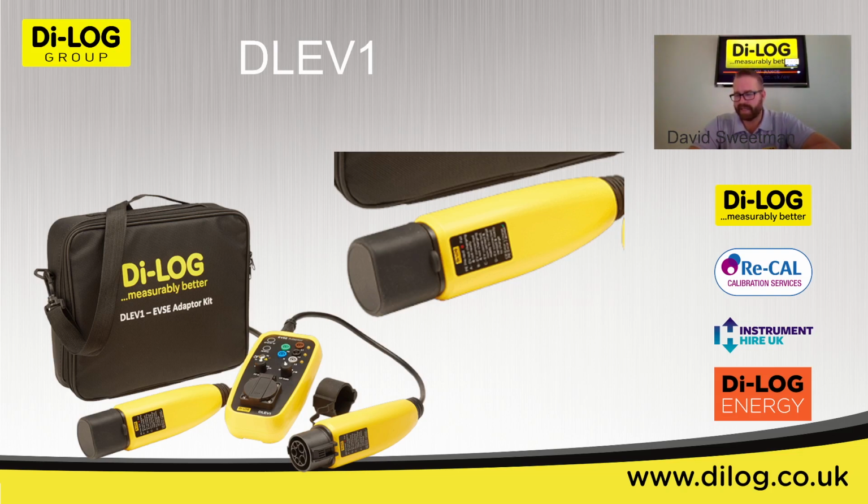Control pilot position B is EV connected and not charging. So when I say connected, this is testing the mechanism that locks the charge lead into the charge adapter and the charger itself. So you're not going to plug your vehicle in and your nice expensive lead go missing when you return to your vehicle. So that's an important feature. It also means that you can't disconnect that lead from the charger whilst under load, which is quite important really, because you've got high currents passing through these, and if you disconnect it all of a sudden, that could be a potential safety risk as well.